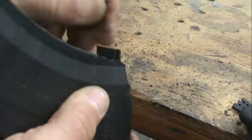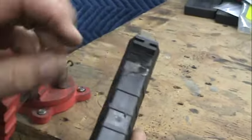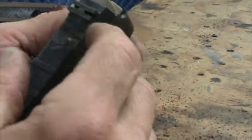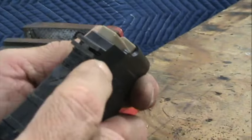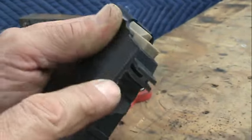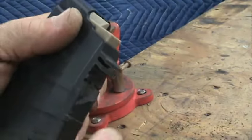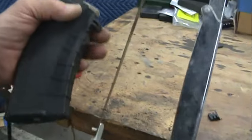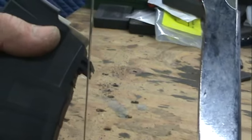There we have it — this one cut. We've got it all cut off. We just need to take the cutting wheel and smooth this out so it's not so sharp and it looks a little better. But before we do that, we'll go ahead and cut this angle here on the top, just like we did before — cut the top of the lug at an angle, just like that. With your file, you can smooth off the edges a little bit.